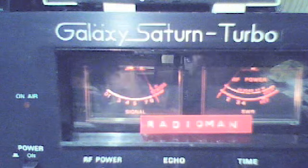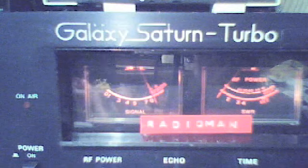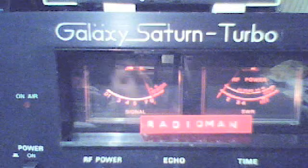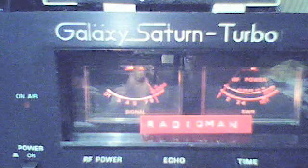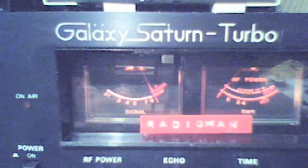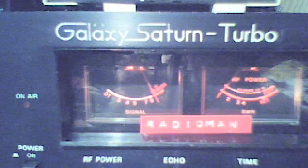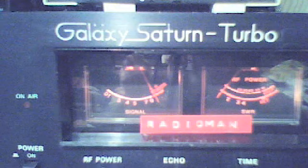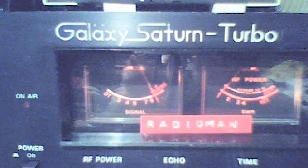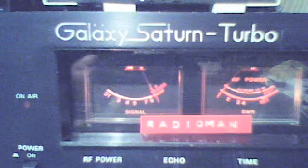The question is, do you have your impedances set up right, where you got highs and lows, or have a transformer to transform the high frequency and low frequency, high impedance and low impedance content, so everything will be sonically on point. Some radios play well going directly into the microphone jack, but other radios you got to do some other things in order to get it to sound good.